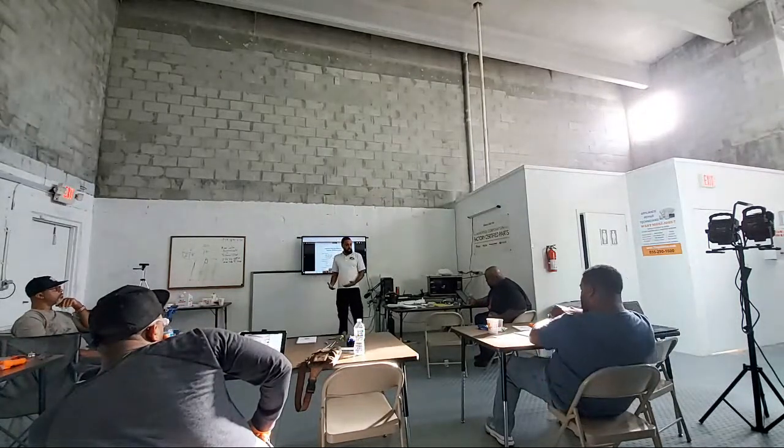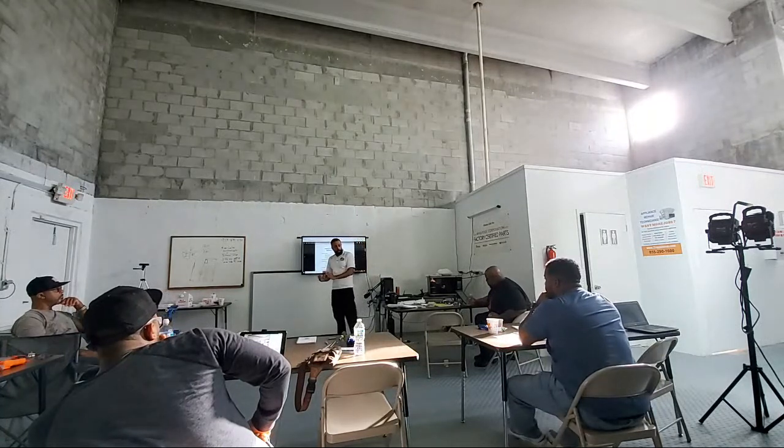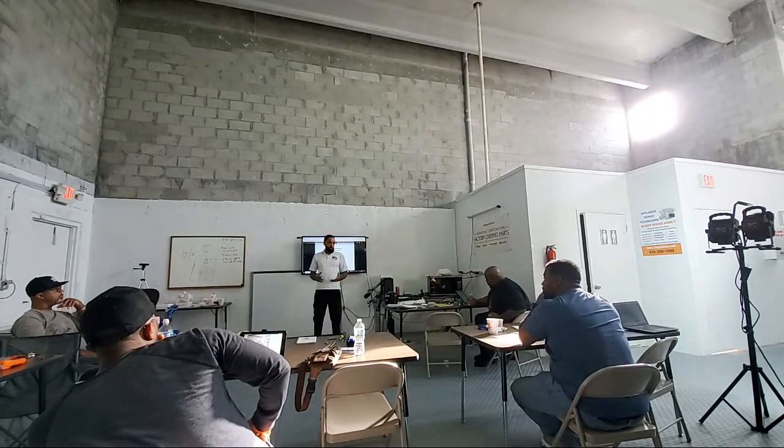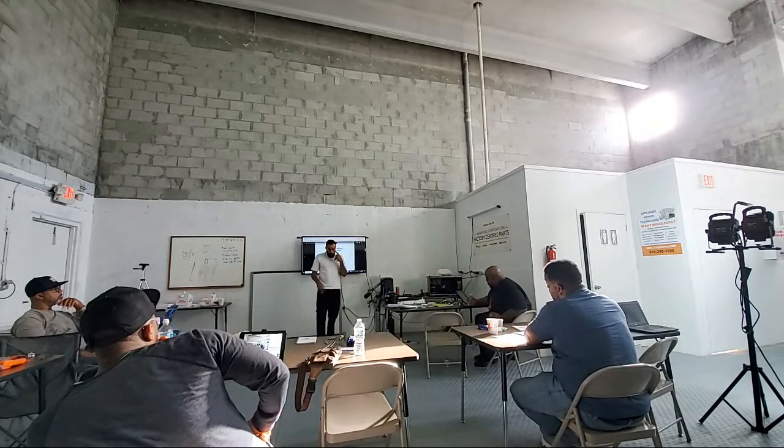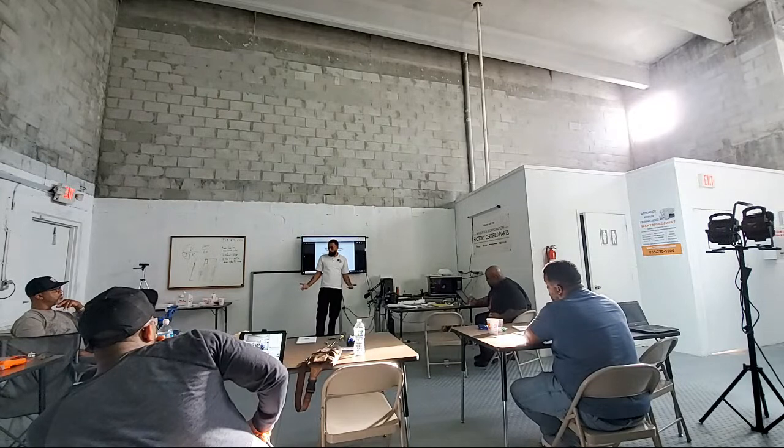And we know what we're supposed to have. We're supposed to have this, we're supposed to have that. So we're using all of those tools like a detective, trying to get to the bottom of the case. We're gonna listen to the fans. While you're there, open the freezer door, put your eye on the back wall. Do you see it frozen up? See it full of frost? Open your fresh food door. Put your hand by the dampers. Do you feel air coming out of it? No.